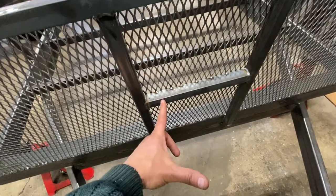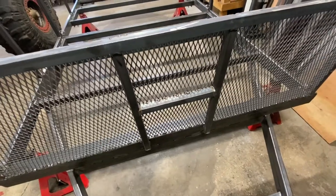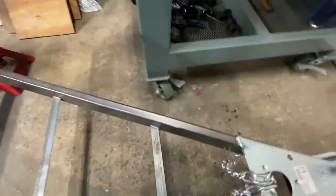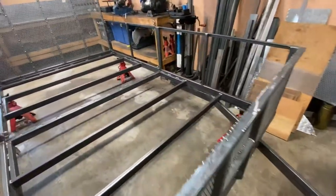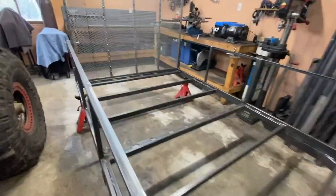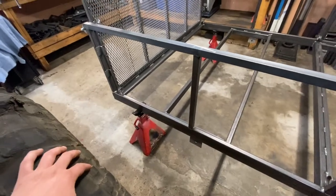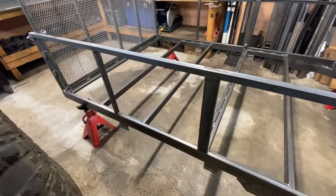What's left is I'm going to put a tire carrier here. I'll weld some long bolts spaced out by 4.5 inches - I need the tire and wheel, which I don't have yet. I'll also weld some washers along the rail as tie-down points for the electrical wires and fenders, which I don't have yet, and finally the lights at the back. It's pretty close to getting done - probably another day of work, then paint, and install the axle.